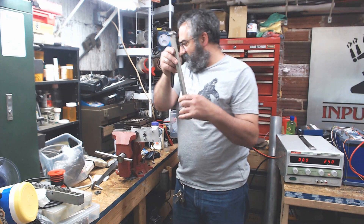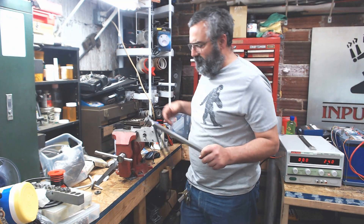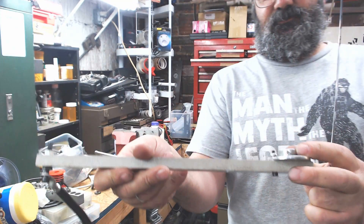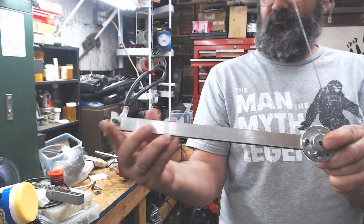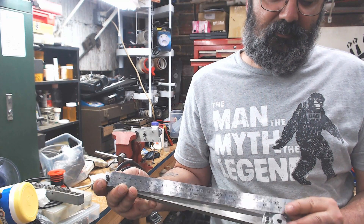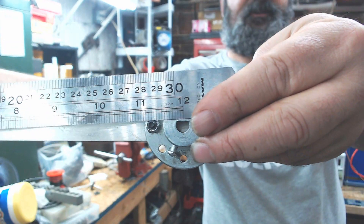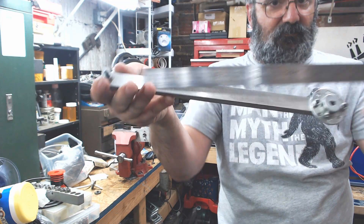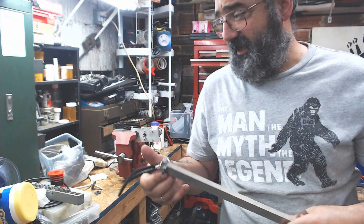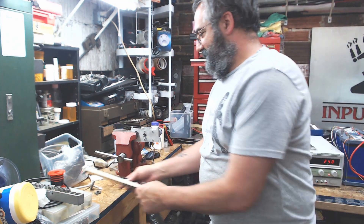My methodology is sound. Since they'll be seeing this video — between this point here and here, you can see it is right at the 12-inch mark, within an eighth of an inch — so one foot, 20 pounds: failure of the spur gear. And I hadn't even moved it yet. It failed when I applied the weight, the load.